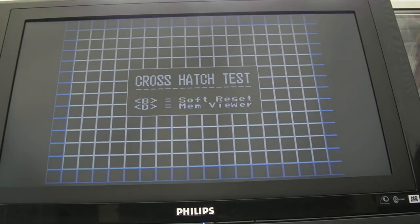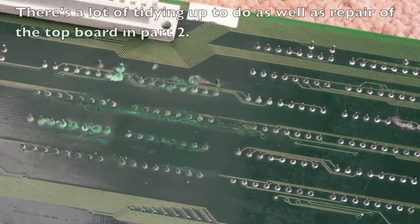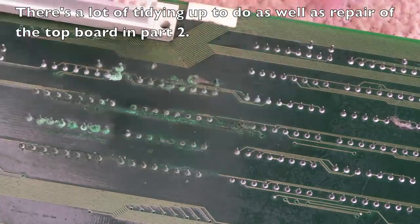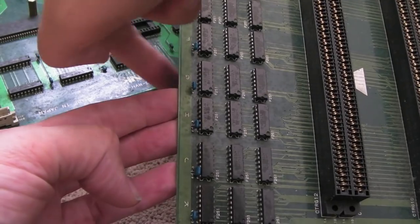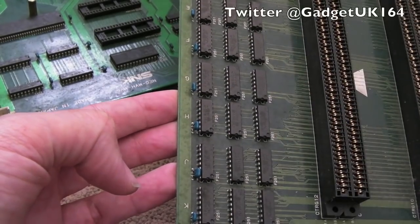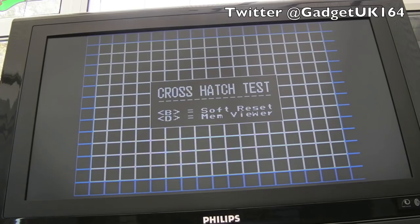I think maybe two of those 245s are used for something else besides the memory card slots. In order to get the slots working we need to get a couple more of those 245s on there. The HCT ones are pretty sure for the memory card slots CN7 and CN6 because the traces go straight to them. But there is no more mystery - this is the underside of the top board and you can see the corrosion here. The battery sat on the other board just underneath, so the corrosion vapors went upwards or the board was sat upside down. The main thing is it's up and running now. Thanks for watching, I'll catch you in the next video.